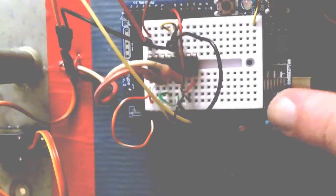Oh, I guess I should say, and let's switch into the zoom again, I had been using, for the controller, basically the Arduino. I was using a transistor to turn on and off the power, and I was using the 5-volt control voltage from the Arduino to switch on and switch off the 9-volt power to the motor itself. But I've switched over to this, gosh, what is it, a 754410 half H bridge motor controller chip, and it will allow you more easily to control forward motion of the motor and backward motion with just a couple of pins. Well, 3 pins actually for the Arduino.